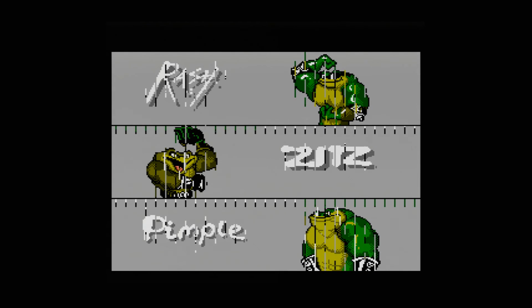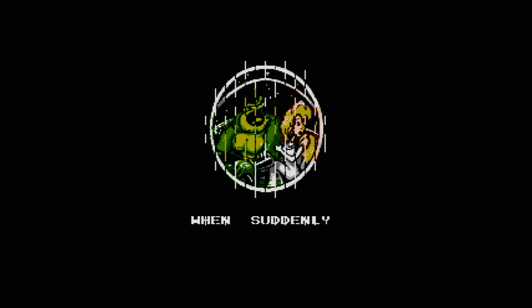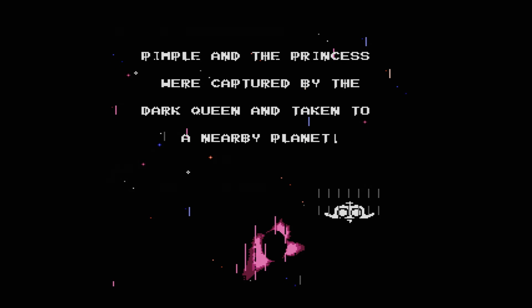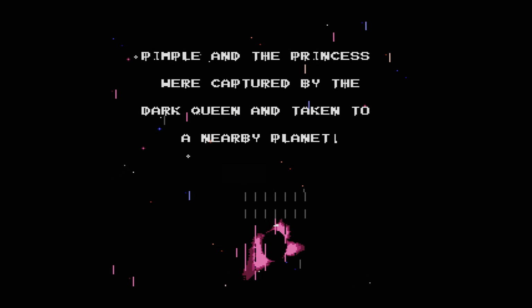So I went back, desoldered it, added some wire to the leg, and resoldered it. I checked every other solder point and everything looked perfect, so I fired it up again and it still looked like this. It seemed pretty odd to me that the video would be super sharp but have buggy artifacts over the sprites. I was worried that I might have damaged the PPU from the heat of the soldering iron or from when I grabbed it with the pliers, but that's when I remembered.